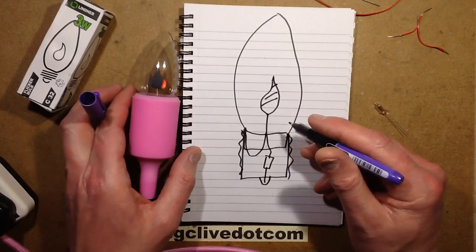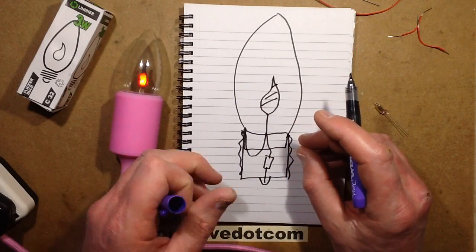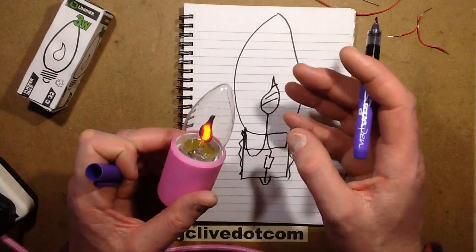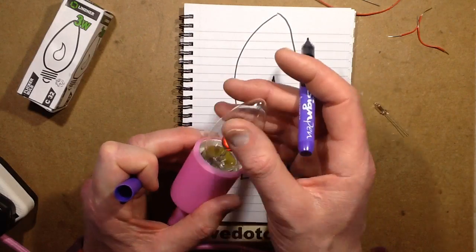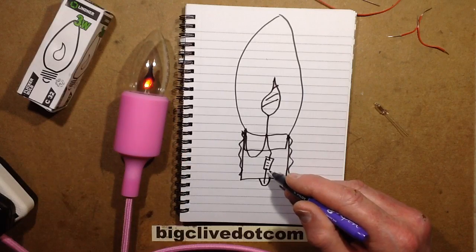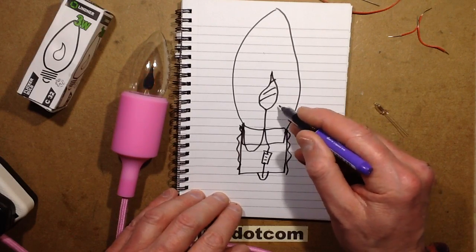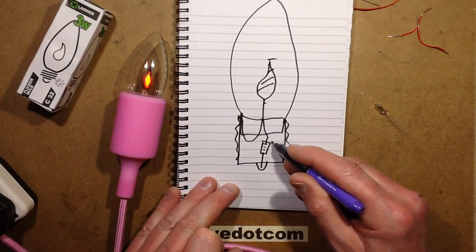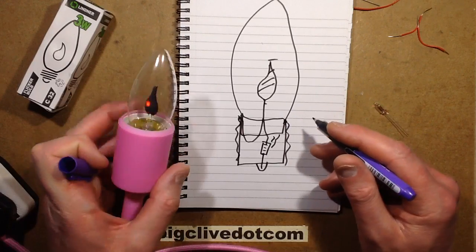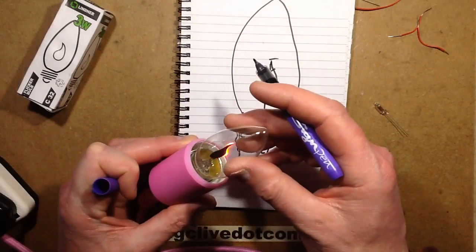And if you overdrove it - I did this with a lamp I got from America when I was visiting. It was two half spheres, the size of almost like a ping-pong ball, and they sort of shimmered over the surface. I briefly put it on 240V just to see if it makes the whole thing light up, and it did, but it also sputtered quite rapidly - the metal was effectively sprayed off from the electrodes and coated inside the lamp, and it went black very quickly. In the UK, because our voltage is much higher - in the region of 230 to 250 volts - you end up dropping about 150 to 200 volts across that resistor at the same current, whereas in America at 100 to 120 volts you only drop about 50 to 90 volts across the flame itself.